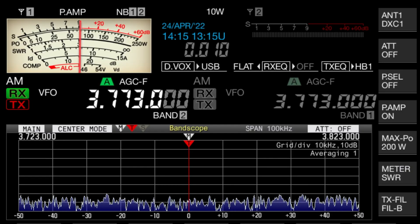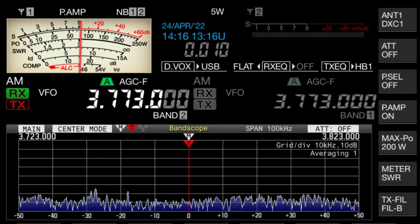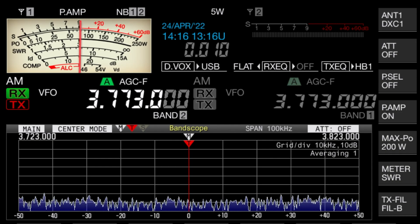You've got to remember the whole point of this is to keep your radio happy. As long as the SWR isn't huge and your radio is comfortable, it'll pump all those wiggles and most of it will end up going out into the ether. I've just set this radio on every band on AM. You've got to remember I have a special license — I'm allowed to transmit up to 1500 watts without using my call sign, using an industrial license called an Innovation Trial License. So don't you do this. I'm only transmitting — it says here — 10 watts, actually I'll turn that down to five. Chances of causing any interference are few and far between, but you can see the curve as I spin the dial.